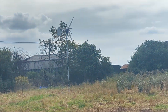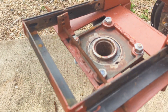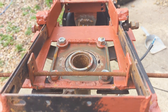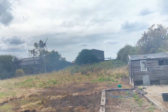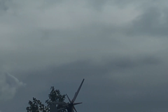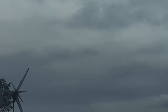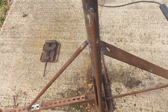Obviously we've got this heavy motor at the back, but the blades — believe it or not, the blade hub assembly is approximately 25 kilos. So once that's going, that's the reason it puts out so much power — it's got the 1.8 gear ratio and 25 kilos moving at 300 rpm. There's a lot of energy to be had.